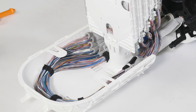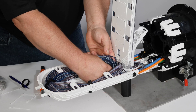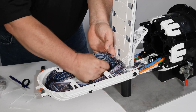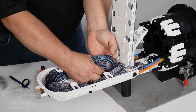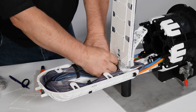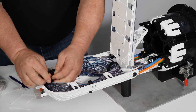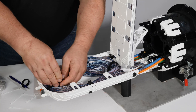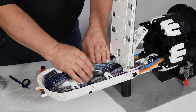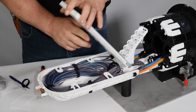This outbound fiber or tube should be retained loosely until fiber is secured in the splice tray. Mid-sheath or slack loops are stored in the basket with up to four points of retention. Carefully place the fiber bundles or tubes in a figure-eight pattern, alternating direction to reduce twist. Once the last coil is in place, fiber in the basket is typically retained with velcro using the soft side to the fiber or tubes. Make sure the fiber or tubes are secured and clear of all basket tabs, then install the splice tray and begin splicing.